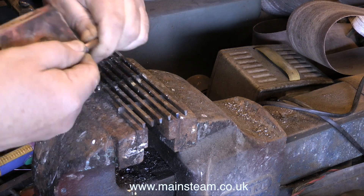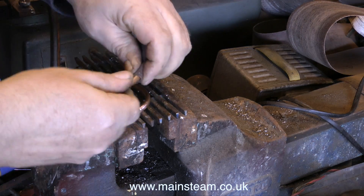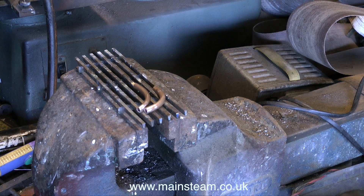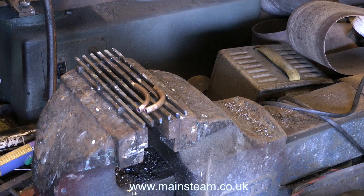I'm going to the outer part of the workshop now where I do the silver soldering. The first thing to do is to clean up the work. I'm cleaning up one end of the pieces of copper piping. This clean end is going to be silver soldered into a union nipple, which will allow me to bolt the pipe onto the fittings that I've just fitted to the engine.